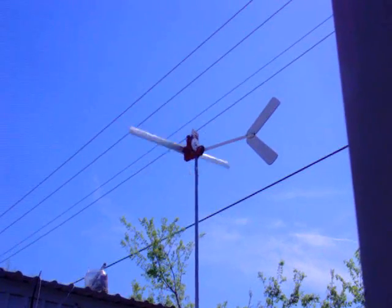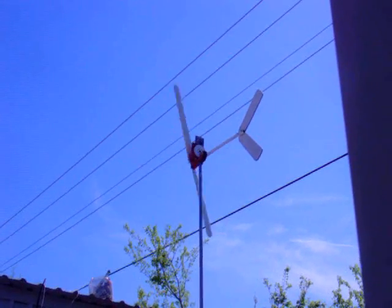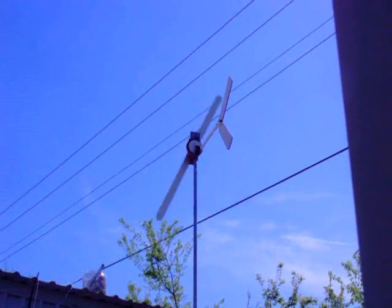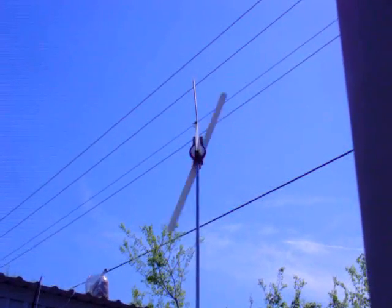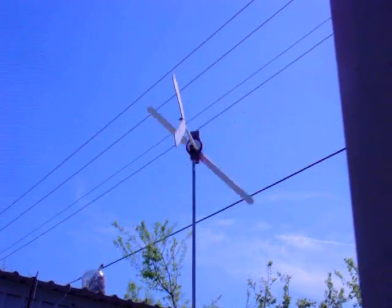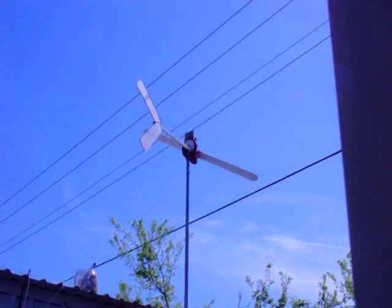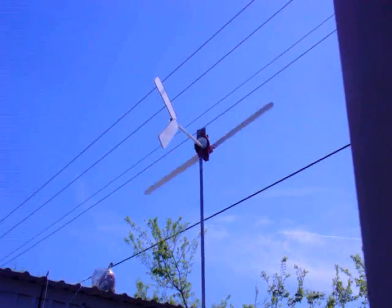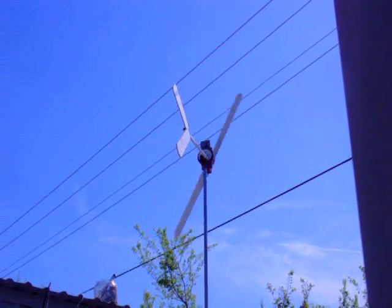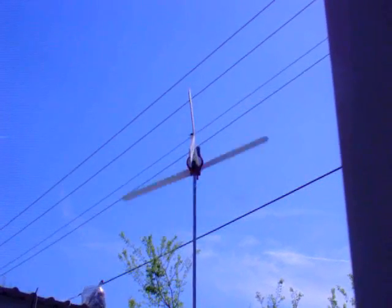This thing will keep spinning — when the wind gets down to 3 mph I've seen it keep going down to 2 mph and hold there, then pick back up. Once it reaches cut-in speed and gets lift, it doesn't stall out for anything. It takes 170 RPM to reach charging voltage, which is right at about 5.5 mph wind. It doesn't stall — it'll keep pushing amps as the wind picks up. I've seen it go from about half an amp and then slam up to 3 or 4 amps. And like I said, it blew that 20-amp fuse.